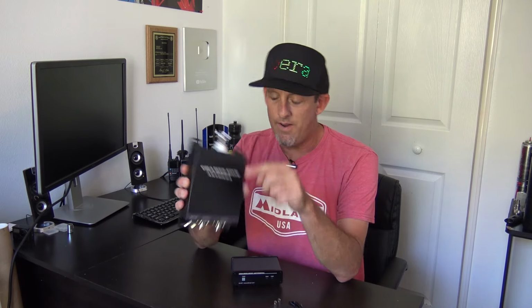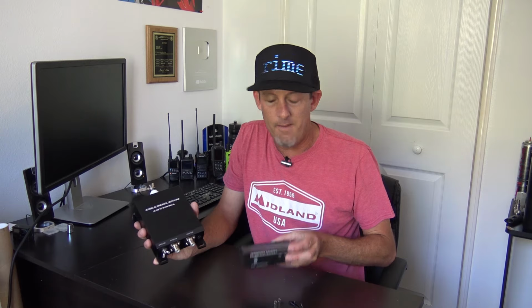Random wire theory. Now, let's say you follow the manual and you put a piece of wire on here, I'm going to guess 71 feet maybe, right? And you go up with that, you make it a sloper, and you hook your ground counterpoise up to here and you hit the tune button. Well, what's going to happen is this plus that wire and this equals your tuned antenna. Everything coming out of this that goes to your coupler here is a good match, all right?